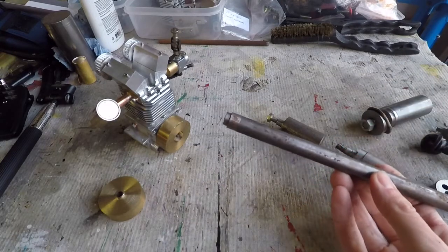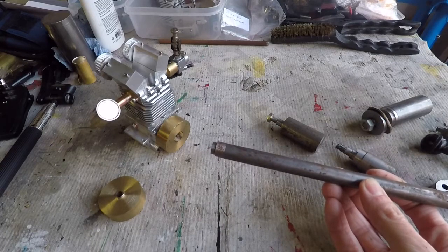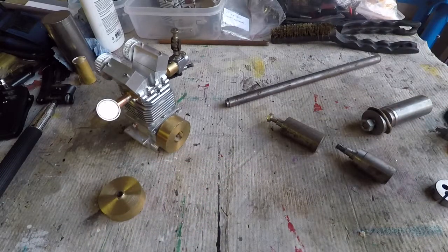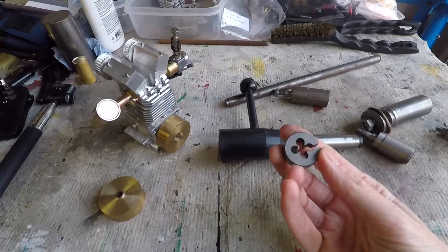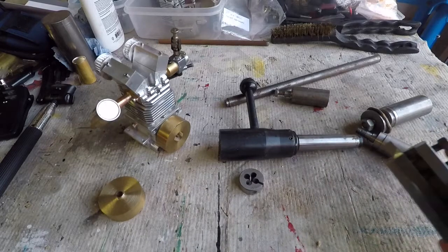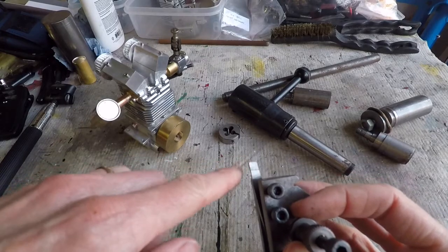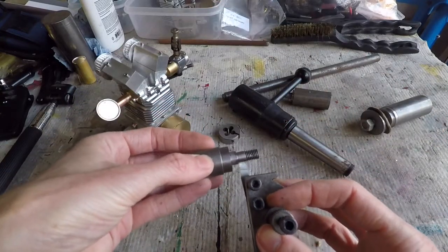So this bar is what we're going to be using. This will go straight into the chuck through the bore of the spindle and we're going to machine the stub mandrel on this end. We're going to be using the tailstock die holder with a six millimetre metric die in it, and to machine the stub mandrel just using a normal turning and facing tool — one which has got a pretty sharp point to get into the corner of the piece.